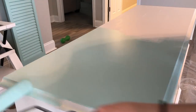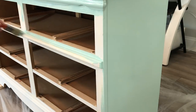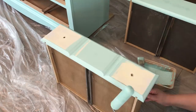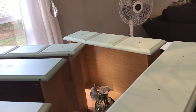After sanding down the wood filler, I went ahead and started painting. I used basic latex paint. After the first coat, that's when disaster struck for the first time. After the first coat dried, I noticed that where I had done the wood filler to fill in the holes I had not sanded it down enough, so it was completely lumpy over every part I had filled in. But I wasn't going to be deterred — I went ahead and sanded it down as flat as I could and repainted the drawers.